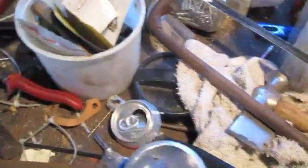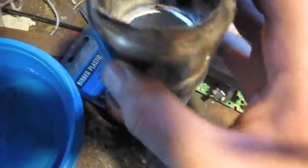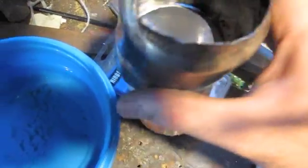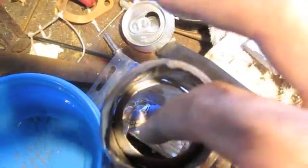What I'm going to try to do — I'll have to do some more cutting — is put the turbine in the back between the first and second cans. That little lip that the bottom can makes, I'm going to put a paper towel around the inside and soak it with lighter fluid. That will act as the flame holder, making a nice little eddy that will hopefully drive the turbines and keep the whole thing running.